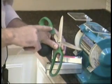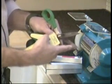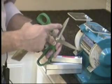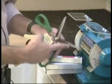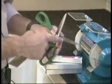When corrugating an industrial scissor, you always corrugate the thumb blade or the bottom blade of the scissor. This is because the finger blade is the blade that does the cutting. The bottom blade or the thumb blade is the one that does the holding of the material. That's why you always want to corrugate this blade.